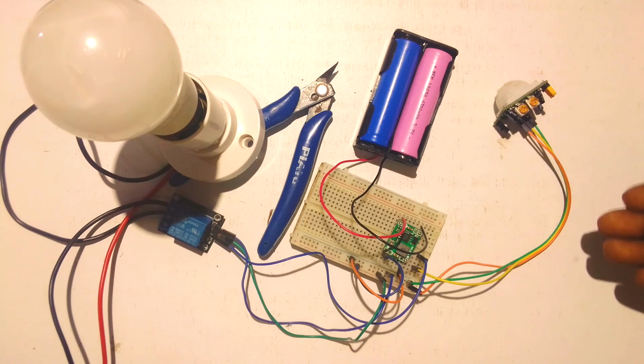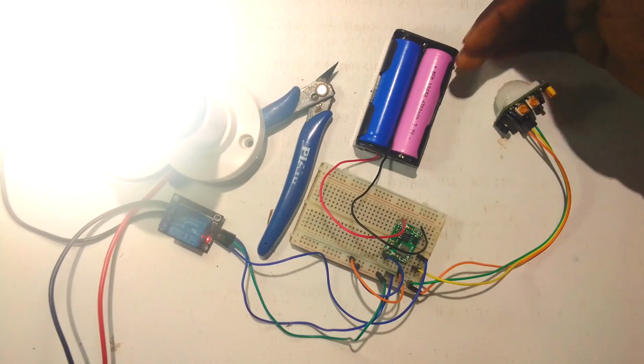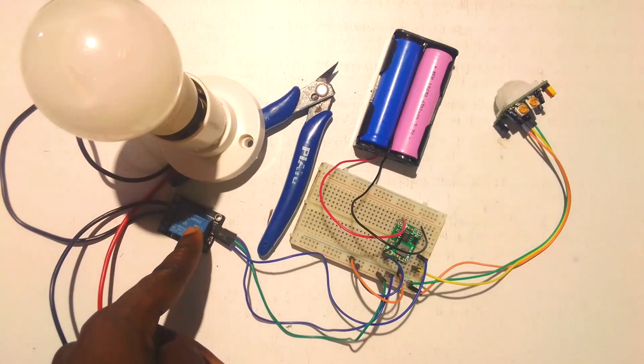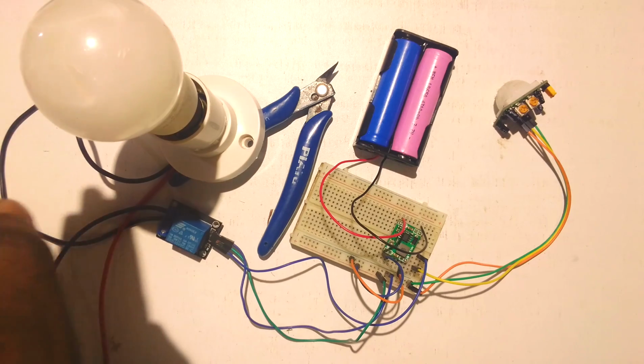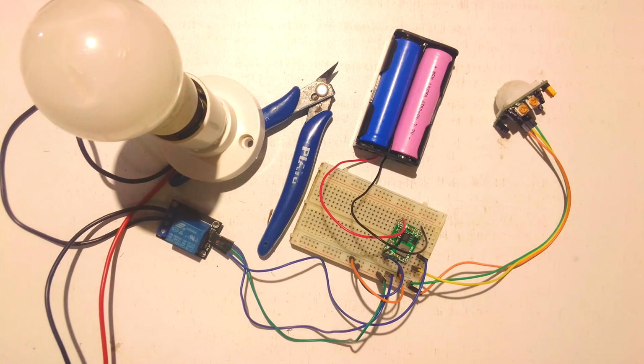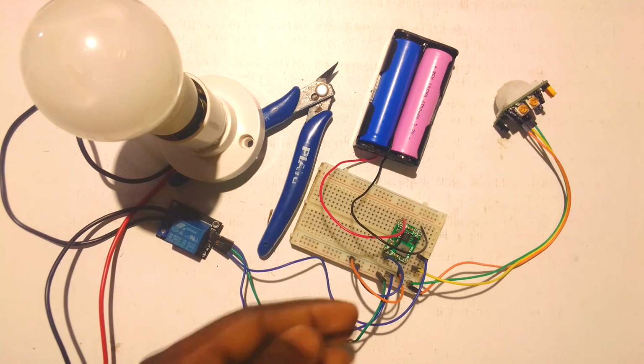When a motion sensor detects infrared from the space, as per now, it sends a signal of 5 volts to our relay module. But the relay module is controlled by 5 volts, and then it controls the lamp through the normally closed pin. So, also, in our system, we have a power pack. The purpose of the power pack is to produce 5 volts DC that is consumed by the relay module and the motion sensor.